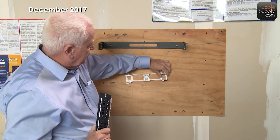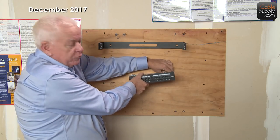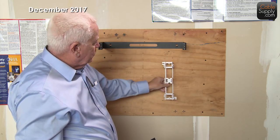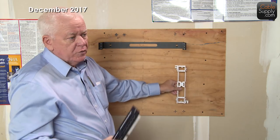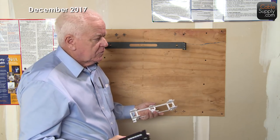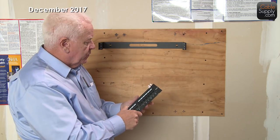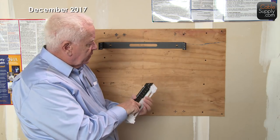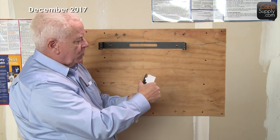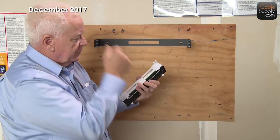Normally, because the standoff bracket has been used in the past for other equipment, it's usually mounted this way — that's why it's called a vertical patch panel. But there's nothing that says you can't do it sideways. Some people prefer that because the numbers read more easily. It's also a space saver on a small backboard to have it go this way, especially with other equipment like routers and switches or cable TV supplier gear. These little arms right here — if you push them back, they snap off or snap on. If you break one, it's easy and inexpensive to get a replacement.